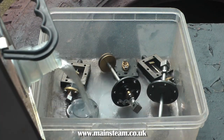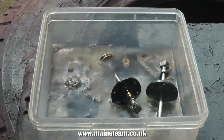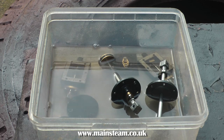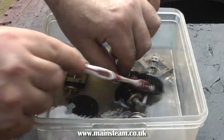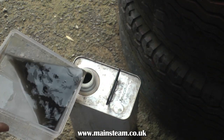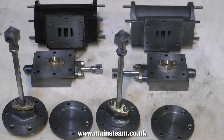I have a personal preference for not having paint on the cylinder covers — only on the cast part, the part that's left rough cast. With the machined part of the cylinder cover, I like this to be left in natural cast iron. There's no real rust problem; you can always wipe it over with an oily rag, like in full-size practice, and it looks so much better. Because if you tighten a nut onto a stud without a washer, you're going to chew up the paint. Cellulose thinners just dissolves the paint, and once I've finished with it I put it back into a tin of dirty cellulose thinners and use it for other jobs.